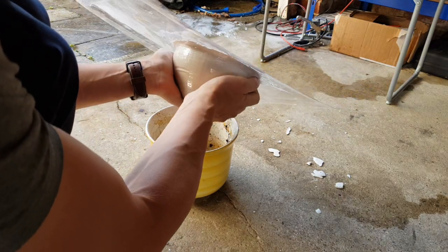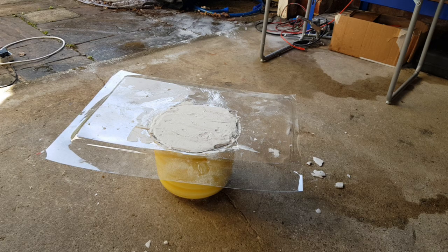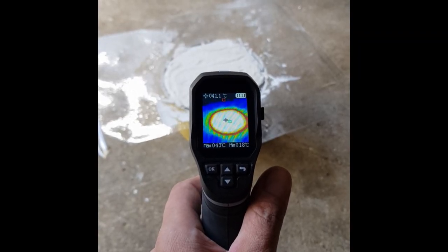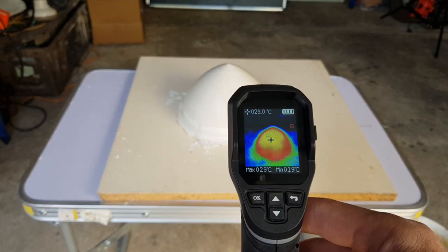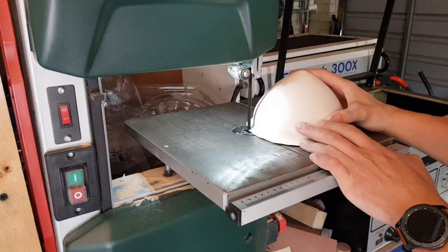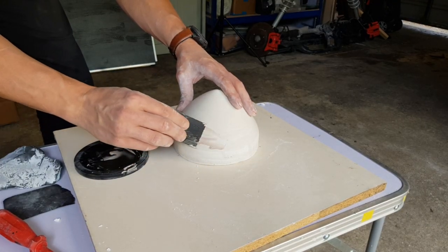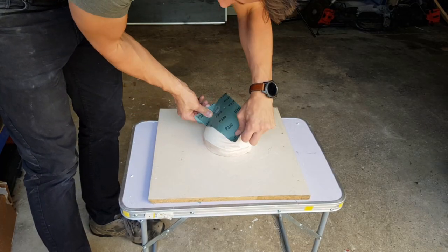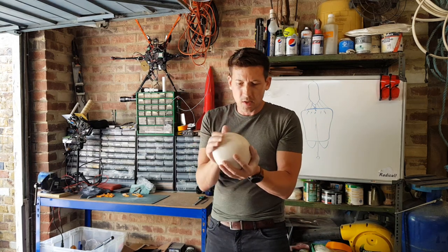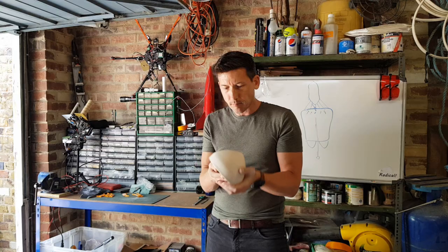It's really really hot - I think it's still going off. I'm going to leave it until it cools off so I know the chemical reaction is all done. The temperature is actually going up, which wasn't what I was expecting. One hour and 15 minutes later and it's cooling down. Three hours later we've got a nice vac-form mold for our nose cones - it's looking really smooth. It might need possibly a little bit more filling and sanding, but we'll pop it in the vac former and see how they come out.